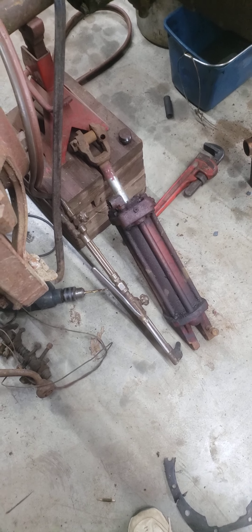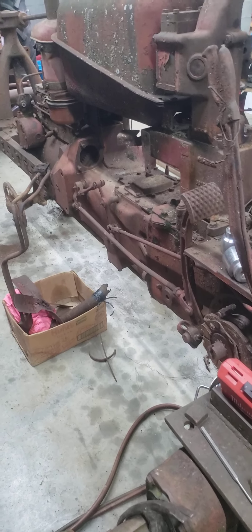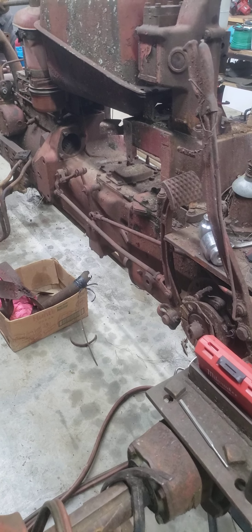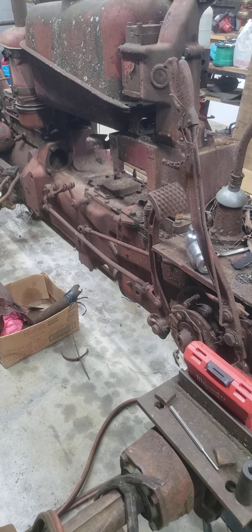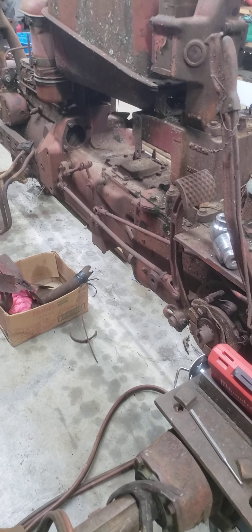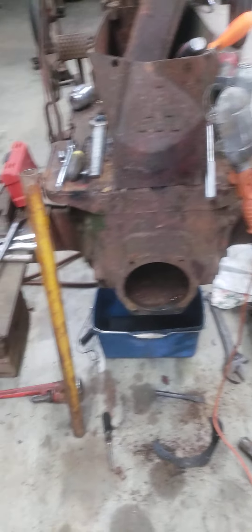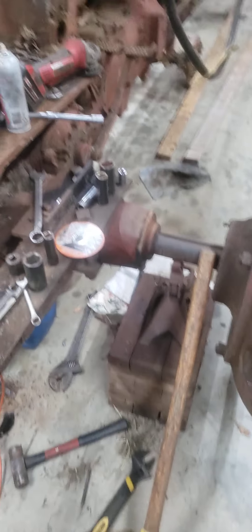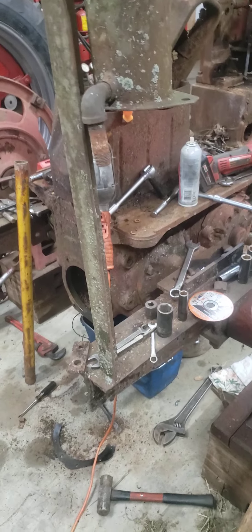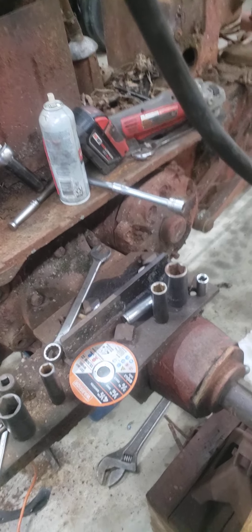I managed to score an international cylinder with a straight ram in it, so I'll be tearing that down. There are a lot more parts on this — I'm going to try to save that TA. My tractor is a factory delete TA, so I don't really need it for personal use, but maybe I can sell it for a core charge to one of the rebuilders. Apparently this tractor had been made into some kind of a spray rig — there are the makings of a spray system and a filtration deal of some sort still left on it.